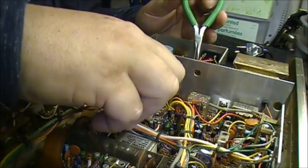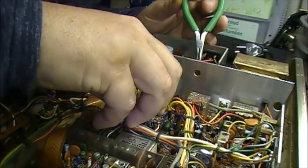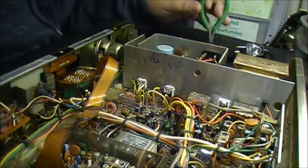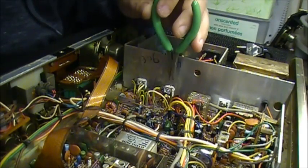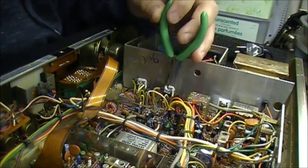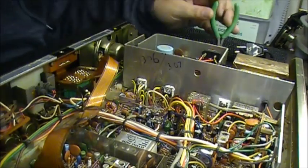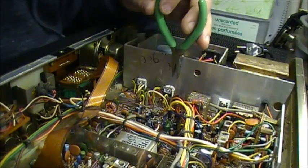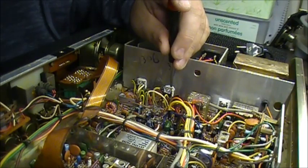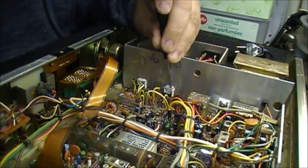And it's also been said about using ceramic insulators, rather, that they don't dissipate the heat as well as the mica insulators. Actually, you got one insulator here completely fell apart. As you can see, completely broke apart, so that'll have to be replaced. They're a bit separated here. I'll change out the ceramic insulators.